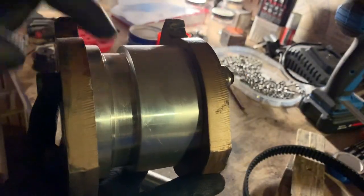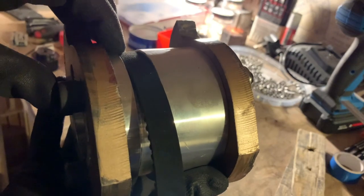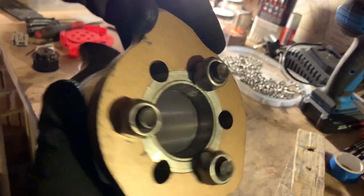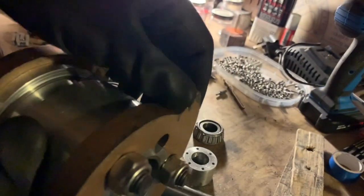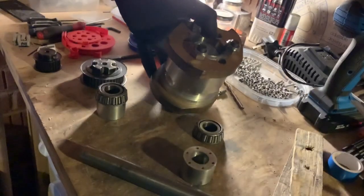The belt sits on both sides of the drum. The recess in the aluminium drum is designed to slip — not to grip — so that when the drum hits something, it doesn't send all that force back through the motor. It's designed to slip basically. The teeth look okay from the Cheltenham event — it hit quite a few things, but the teeth look fine so I won't bother changing them.